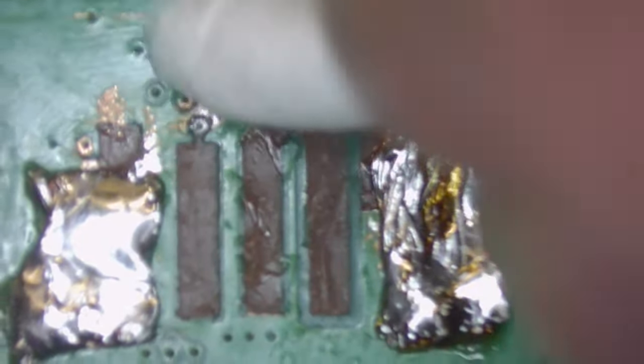Normally, if this wire was covered with solder mask, I would probably push this bit of wick up a little bit. But because there's a wire there, again, I'm not too sure what that's connected to. And the last thing you want to do is short this to ground and cause issues somewhere else. So to be on the safe side, I've dropped this side down a little bit. Doesn't matter because we can still get a connection there for our fan connector.